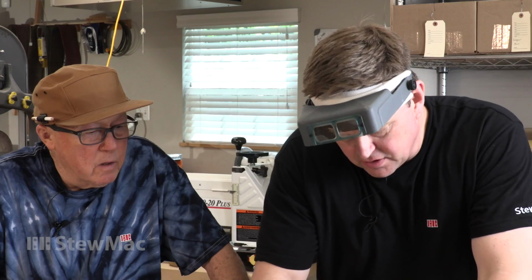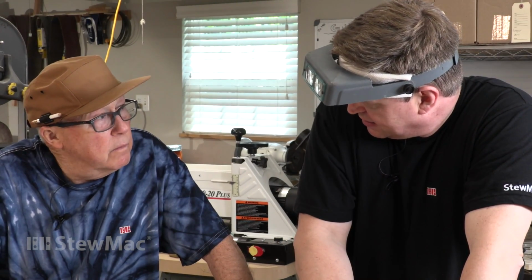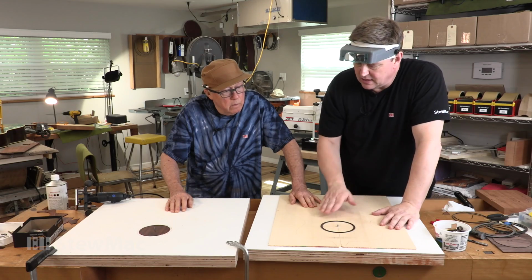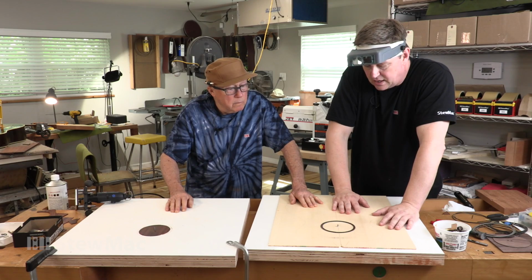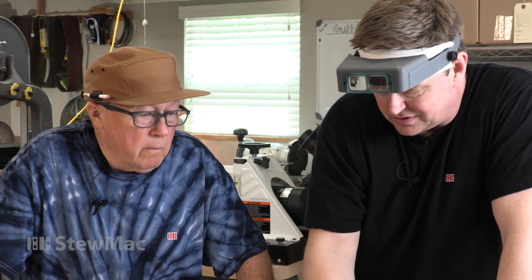Yeah, if it's going in so tight that you think you're either not going to get it out or it's going to potentially break to pull it out, I'll just take everything back out and I'll seal the rosette channel and maybe a little area around it with shellac. You can either use the stuff out of a spray can or a 1 pound cut, because you don't want super glue getting into the end grain of the spruce because it'll discolor it.